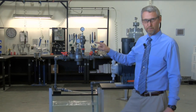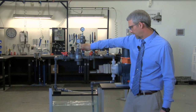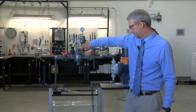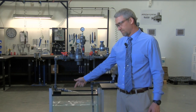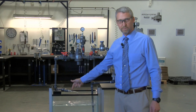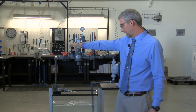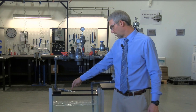The second setup we're going to show is the back pressure valve with the dampener in the system. So we open it up there. We still have pulsing flow — it is definitely much smoother with the dampener than without it, but there's still a little chatter going on, which is not ideal, and I still have pulsing flow.